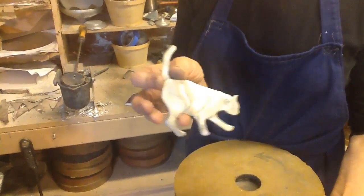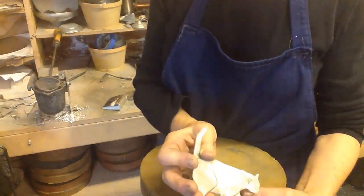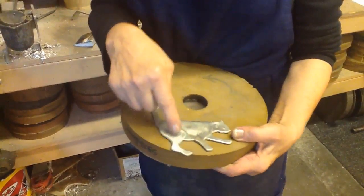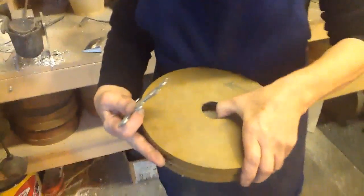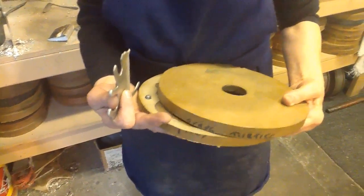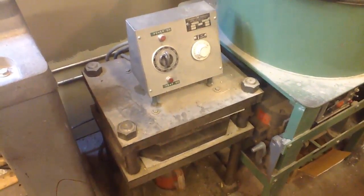In order to create the molds, I first sketch out what I want to make and then I build up layers. I cut it out of pewter and build up layers of pewter and do all the engraving detail on each of my prototypes. Then I put my prototypes within two sections of an unvulcanized rubber mold, and under heat and pressure it cures the rubber around the prototypes and makes a permanent cavity.